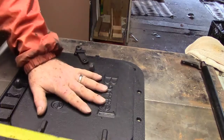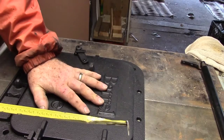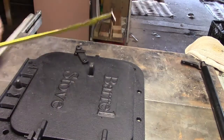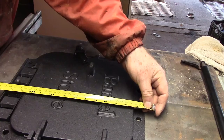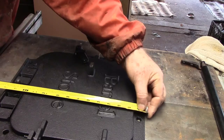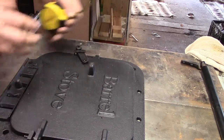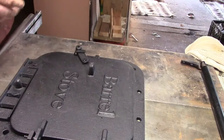I'm going to get some measurements on this because if I put this on the front of that big drum, I'm going to have to weld the plate on it first because the big drum kind of has a couple of jogs in it. I want to get a rough measurement on what size plate I'm going to need. The size of this thing from top to bottom is 14 by 14, so I'm going to go with a 16-inch plate — 16 by 16. That'll give me a little bit extra.